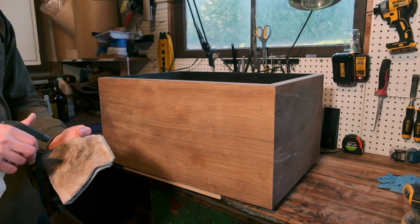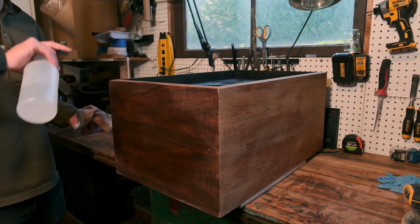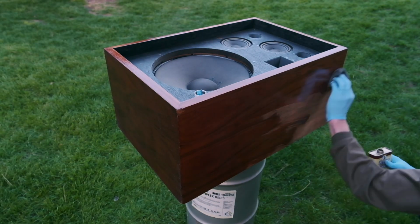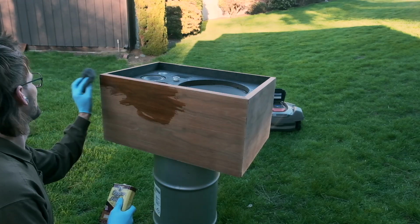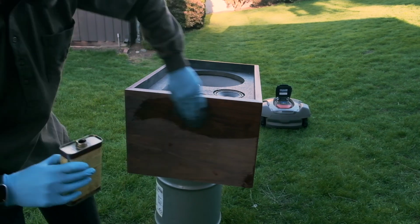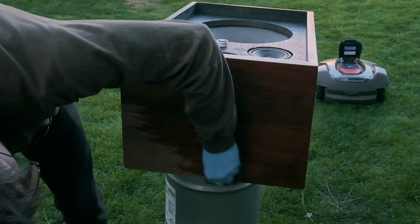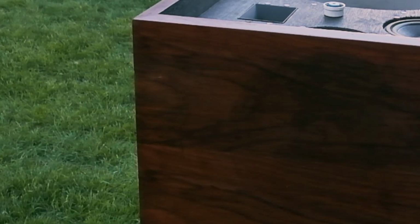To prep the wood for stain, I wiped it with isopropyl alcohol. You don't want to have any sawdust or oils from your fingers on the wood. Howard's Restore finish isn't meant to be used as a standalone stain, but it works great for blending color differences if you remove only parts of an old finish, so it worked marvelously on these speakers. I used the golden oak color and applied it with quad zero steel wool, but if I'd used a darker one, it might have blended the hole in the veneer a bit better, so I'll touch that up later on.